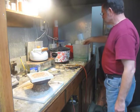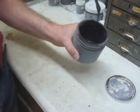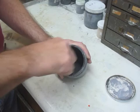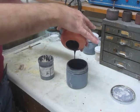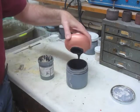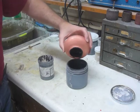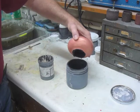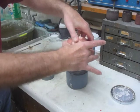The first step in enameling this piece is pouring liquid enamel inside the vessel. We need a coating of the liquid enamel on the inside because it helps control the expansion and contraction of the glass enamel we will be putting on the outside, which I will get to more in part 6. The liquid enamel also helps make the whole vessel more stable and will reduce the chances of the outside enamel from cracking.